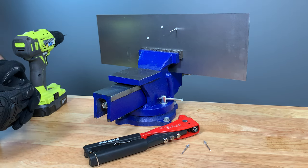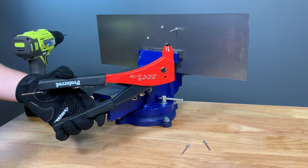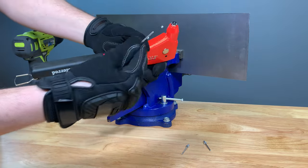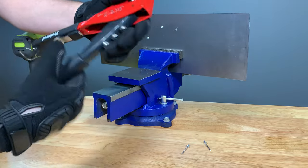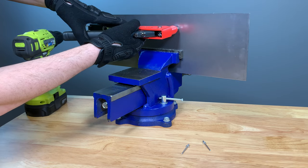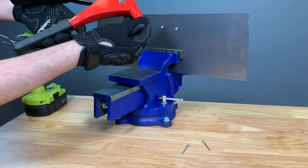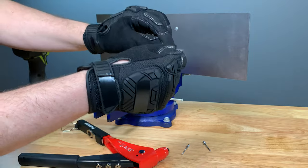Next, we're going to load the rivet into the rivet gun. I'm going to be using our high quality preferred rivet gun. If you do not have one, this exact tool can be found on our website from the link below in the description. This one is inexpensive, has never let me down, and comes with a lifetime warranty through Preferred. To load it up, we're going to take the mandrel end — the stem — and push it all the way into the hole in the rivet gun. Once it's properly seated, we're going to stick the rivet body right back in that hole. Once it's in the hole, we pull the lever, which will expand the rivet and cut off the mandrel. That rivet is now properly installed in the sheet metal. You will also have this mandrel left over, which gets cut out — this is now scrap.